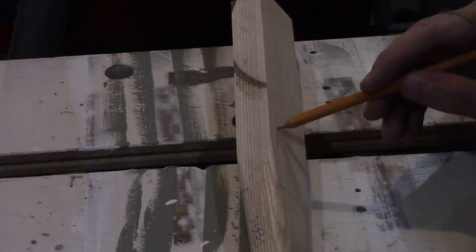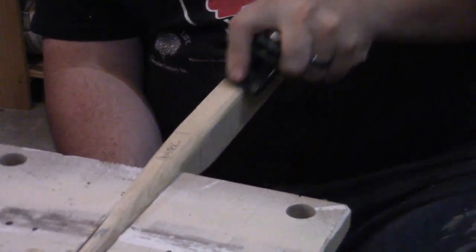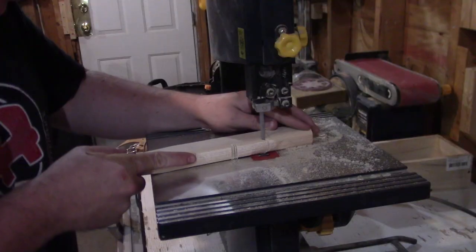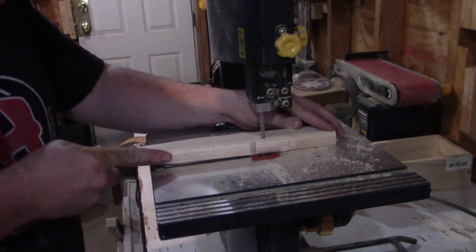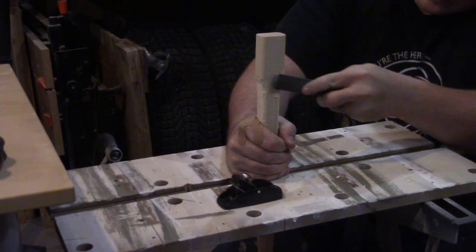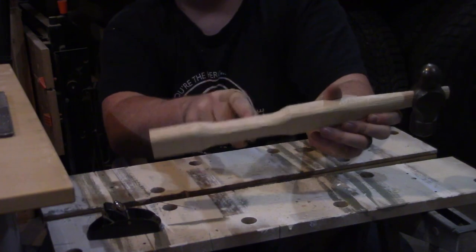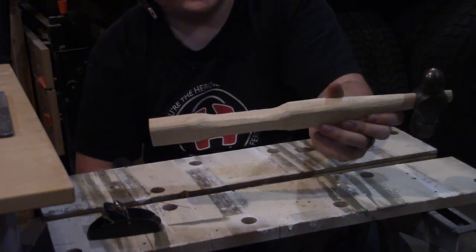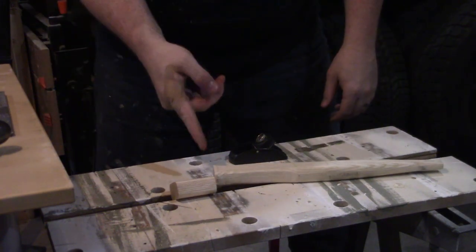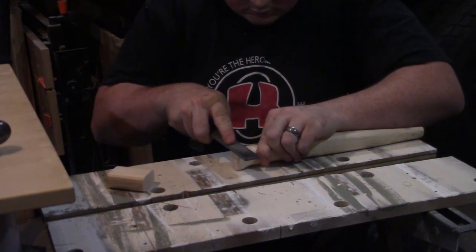Now that the hammerhead is fitting onto the handle, I turn my attention to the hand grip portion. I begin shaving it down with the trim plane again, though I realized I wouldn't be able to do inside curves with it. So I took the handle over to the bandsaw and just eyeballed the curve out on both sides, then brought it back to the portable workbench and filed down the hand grip. After filing, it didn't feel right proportionally — I took off way too much material. So I took it over to the miter saw and zipped off two inches at the end, followed by a quick filing to chamfer off the corners at the bottom.